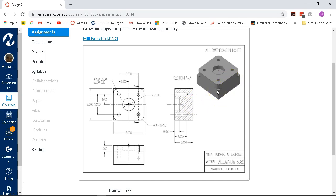Well, now we're talking about a 3-inch cutter. All right, 3-inch length of cut. I'm injecting more harmonic, more vibration into that part, and if it's a rough saw cut, how much am I going to oversize it to make sure that I don't end up cutting these nice little trapezoids that don't clean up? And that's a big chunk of material to have pieces not clean up and go into scrap.